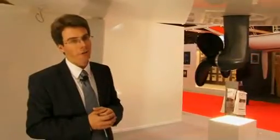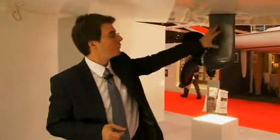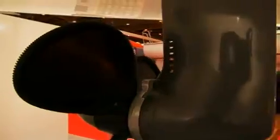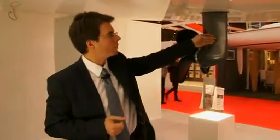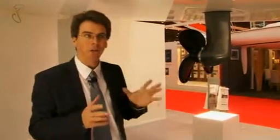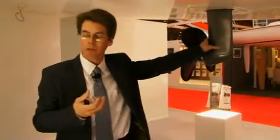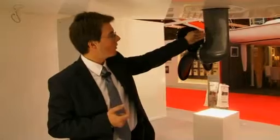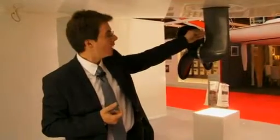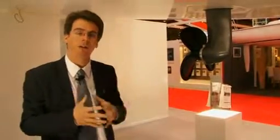The Sun Odyssey 409 and Sun Odyssey 439 both integrated our new technology involving sail drives. The sail drive leg itself, which we see here coming out of the boat, is designed by Yanmar and fitted with the Yanmar engine. This sail drive has the advantage of being very heavily profiled, so in terms of drag, there is considerably less drag than with a shaft system and a skeg. It also eliminates a through-hull in the boat, as the raw water intake for the engine is done directly through the sail drive leg.